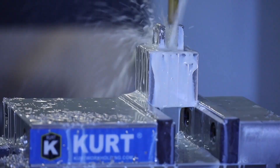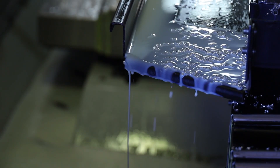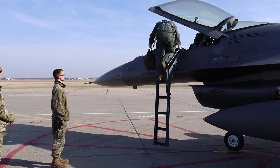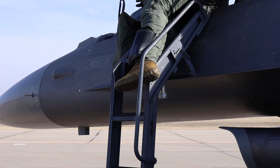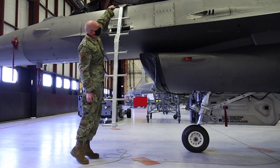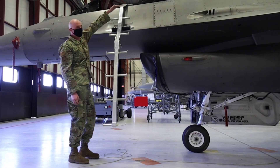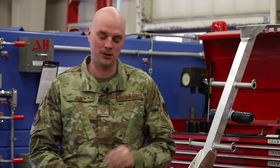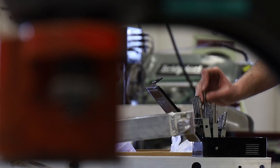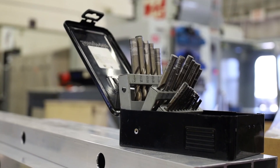We decided to go with using the factory contact points of the original crew ladder. That way there's no question of whether it's going to damage the aircraft in any way, because it's touching the aircraft in all the exact same spots. This angle up here follows the slope of the nose of the jet — it's very subtle but it is important that that angle comes into play. Staff Sergeant Dietrich did a lot of math, figured out the appropriate angle, and I think it looks great.